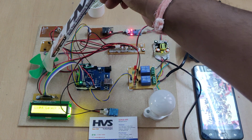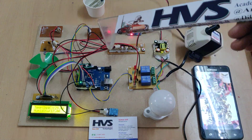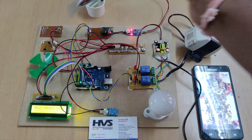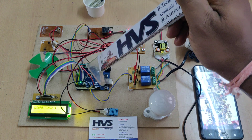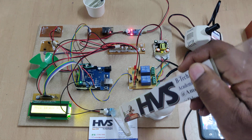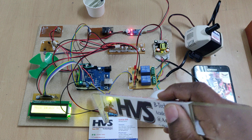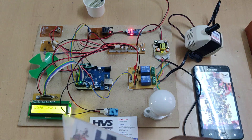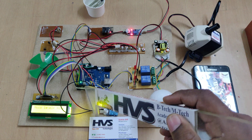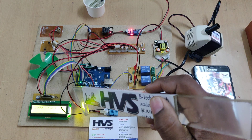The DC motor is controlled by the transistor board. The total inputs are: DHT11, LDR, and moisture sensor — the moisture sensor and LDR are interfaced at pins A0 and A1, DHT11 at pin 10. The two relays are interfaced at pins 11 and 12, the fan at pin 13, the LCD at pins 2 through 7, and the ESP8266 Wi-Fi module at pins 0 and 1.